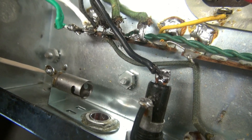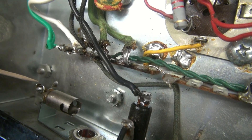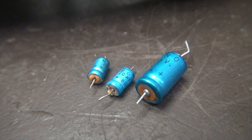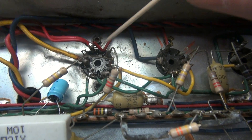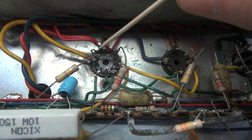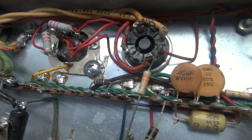The power light is not wired. The reason is when it got here it was actually wired to 120 volts and was blowing six-volt bulbs, so I chopped that out before I ever turned it on. There are the three caps that have been changed — two of them resided here and one over here. I also cleaned up that wiring on the tube socket. You can see the new screws here where the old ones had pop rivets, so it was changed. They just needed to clean up all the arcing and sparking. I've got the lamp wired in and the power is cleaned up. Let's retest it.